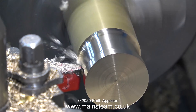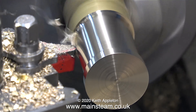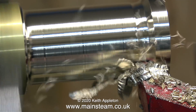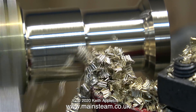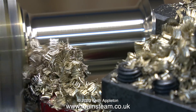And it's a good thing to do in these very strange times. I'm using a round nose tool for most of the turning, because I do want some curvy bits in it. To speed up the job, I did keep dragging the tool back to the beginning — that's why it's making a funny noise. But when I went the other way, I used the auto-traverse, so the speed was far better going from right to left than it was from left to right.